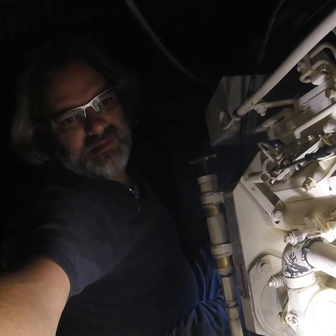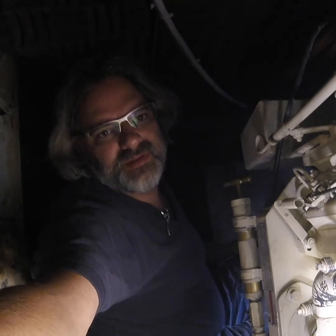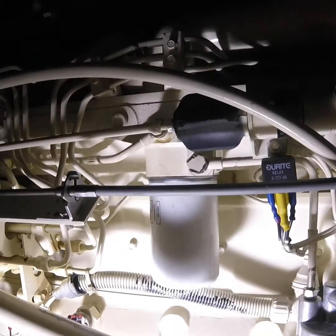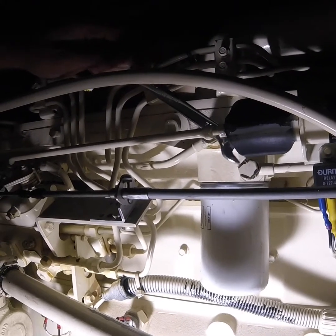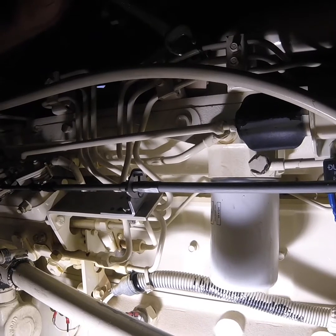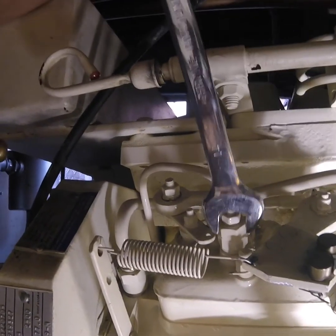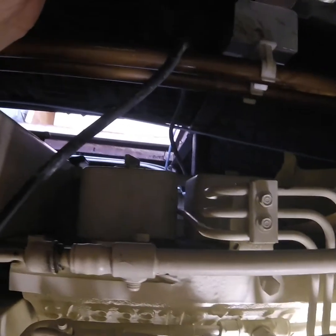The next thing, to avoid this pump dying again, I'm going to install two fuel filters on both of the input lines. Then I'm going to flush the lines so that I have diesel coming out, and pump diesel through until it comes out here and here — making sure we have no air in the low pressure area. Then I need to open this one here because that's the high-pressure pump, to confirm no air in the low pressure area. After that I need to open all the different injectors to check if there is air in the system. Then hopefully she starts running. Cross your fingers — I love working in the engine room.